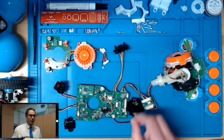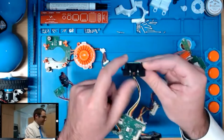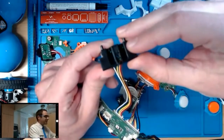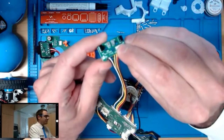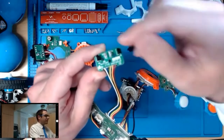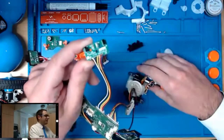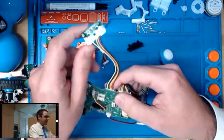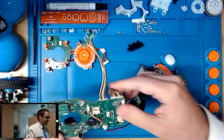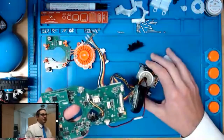So to take a look at how that encoder ring sits within the electronics, we actually have this very interesting circuit board here with the additional black plastic blinders. And so if I take this plastic part off of the circuit board, you can see two sets of IR components, IR transmitters and IR receivers. And so that encoder wheel with the ticks spins inside of this, breaking the beam and then allowing the beam to complete again. And so as that happens many times per second, this creates an electrical digital signal that our microcontrollers can detect and therefore start counting the ticks to determine the odometry that Chuck was mentioning. Francis and David later will talk about how that information is used to actually do meaningful things with our robot.